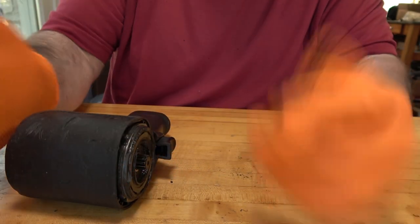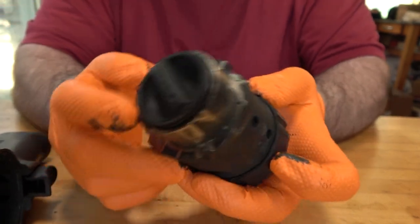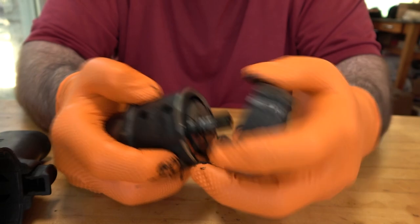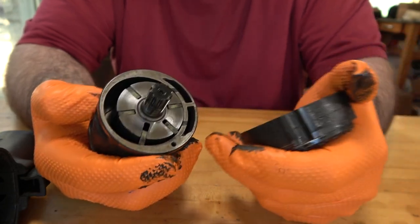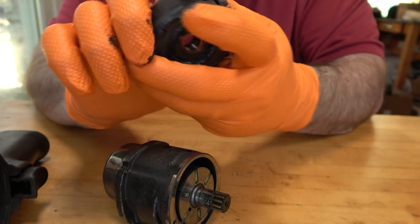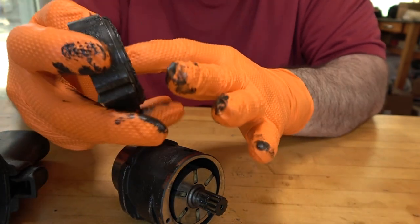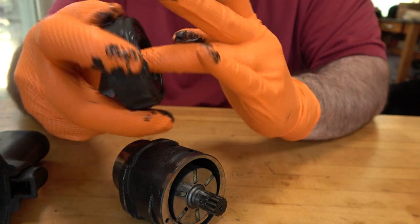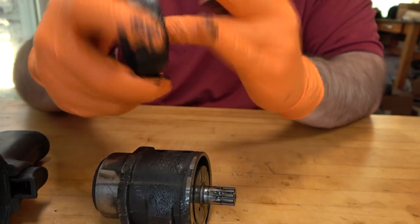It's easiest if for now you just keep it in the hammer housing. Here's your gasket, and so far this looks exactly like a 2235. The rotor housing just drops out of the body and it has a selector switch on the back as well as a plate here. The plate just pulls off and reveals the rotor. The rotor has a spline drive on it and you can see the vanes in the rotor — that's what drives this when air gets cycled through the rotor housing and spins the motor. In the front of the plate is a sealed bearing that usually doesn't come out without doing some work; we're going to leave it in there. These bearings are included in a rebuild kit but they're sealed and unless they're worn out they don't need to be replaced. This one looks like it's in very good condition — nice and smooth, doesn't make any funny sounds.